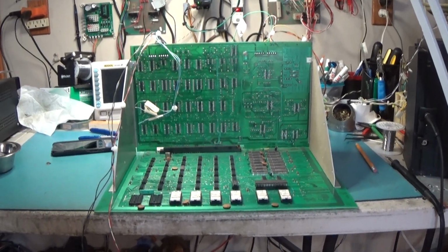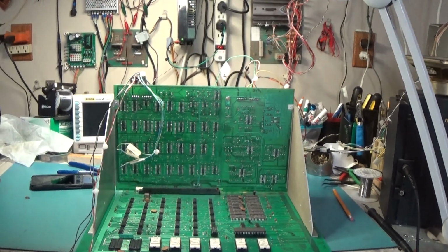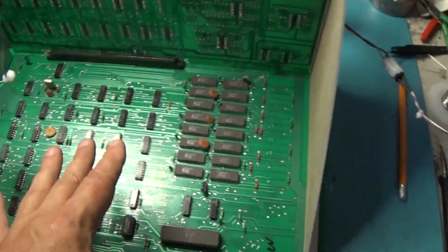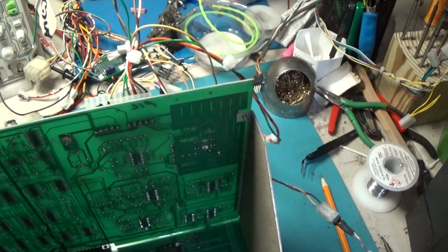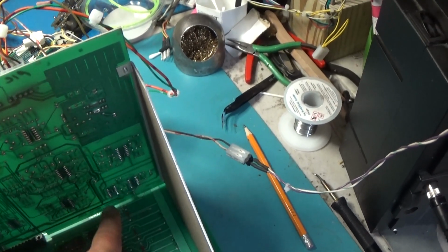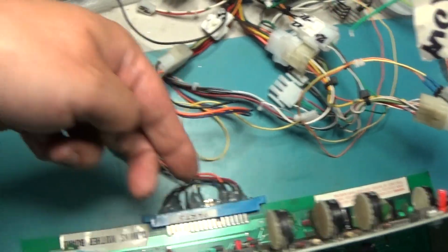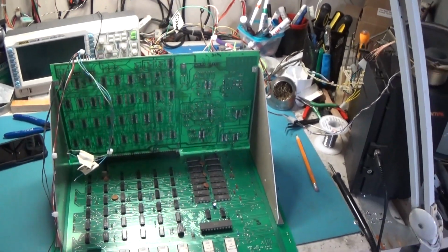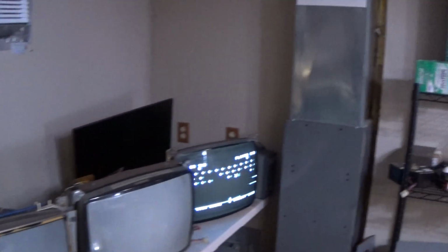Alright, yep, I was able to YouTube this game, the original hardware, not MAME gameplay. And yes, those are the sounds. So we are complete. So this thing, new sockets, caps, sockets and caps all around. Resoldered these headers. All new 3900s, and the noise section, the 4006 and 4030 chip replaced. It had 2 bad 161s and 1 bad 153 on it. And that is it. We are good to go. And this 08, remember, it had a bad 08. So that's it. Midway's Clowns.